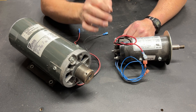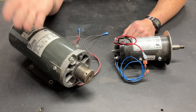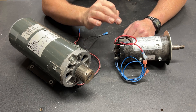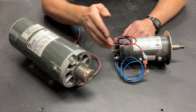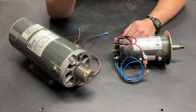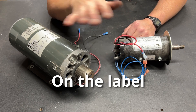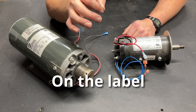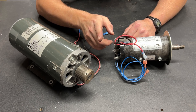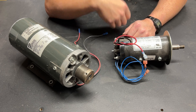In that first video I said torque is king — you have to calculate the torque, as it's the best way to compare your AC motor to your DC motor. That is still completely accurate. But multiple people have asked: what if my motor does not list a max RPM? Some motors only give you a voltage and a horsepower, but not max RPM, so you cannot calculate back to torque. Well, as I said at the beginning — size matters. The bigger the motor is, the more torque it has.